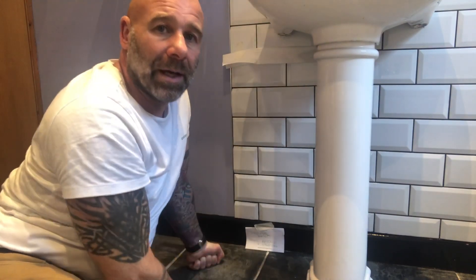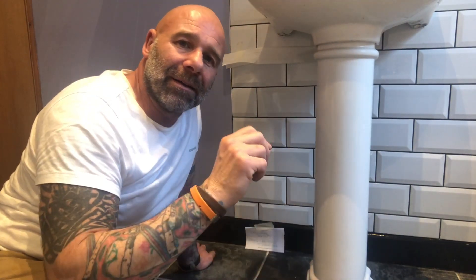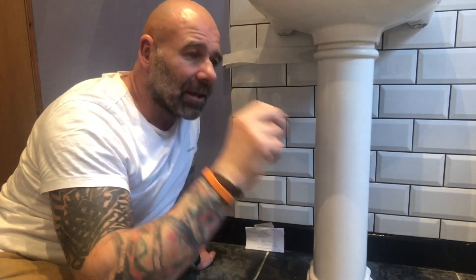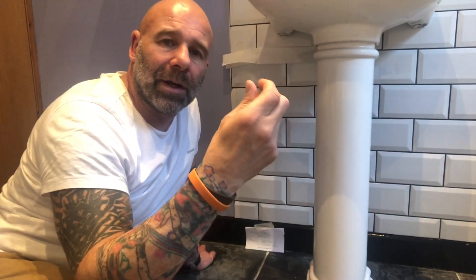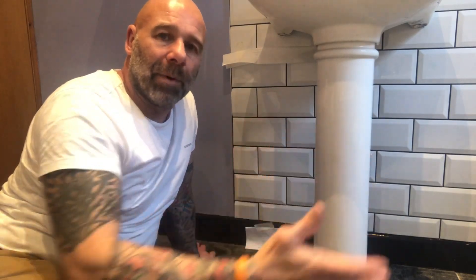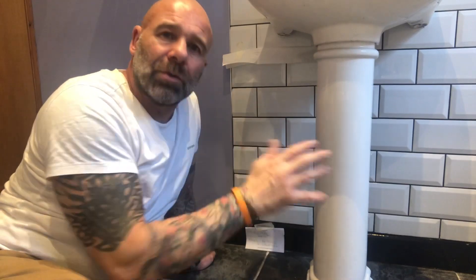That's why re-plastering is put in place using these other methods. The plasterboard method is the cheapest, quickest, and most profitable method on the market — and that's why I've been trying to push it to plasterers, joiners, anybody that can do it. Because it holds the plasterboard slightly off the wall — it doesn't have to be by much. The acrylic is waterproof, water vapour as a gas goes through plasterboard easily, air runs up the back of it because you've left a slight gap, and that evaporates moisture coming out of the wall, which then diffuses into the atmosphere.